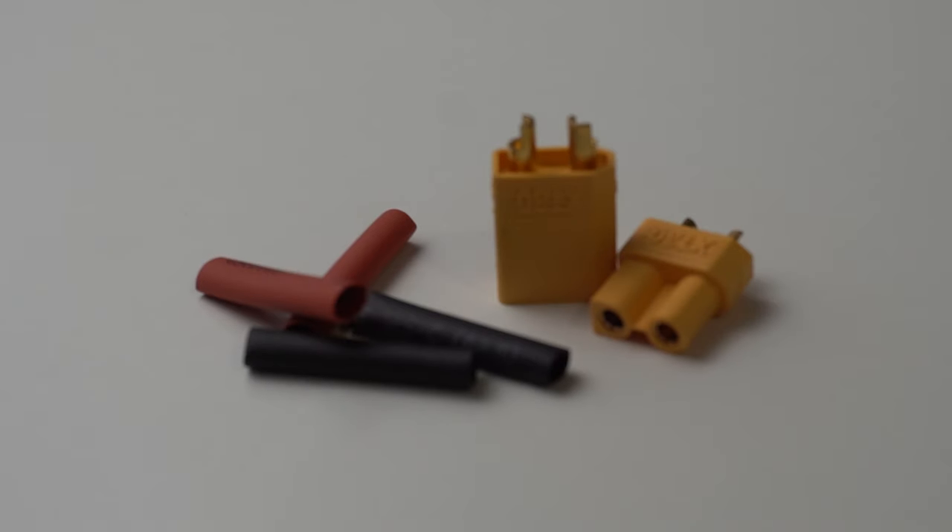As an important disclaimer right at the beginning, be very careful with the batteries and do not short them. They are not protected in any way. This is also why I use a plug between the batteries and the board, as it makes it easier to work with the batteries. You can't switch them off, so you work with a live circuit when soldering directly to the board.